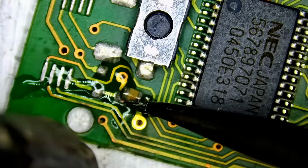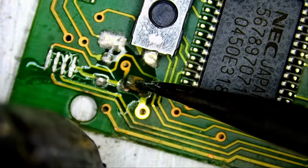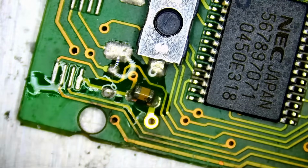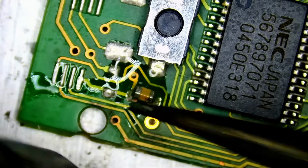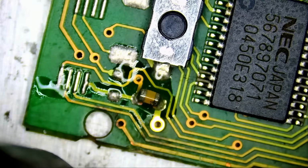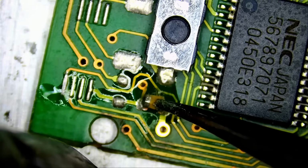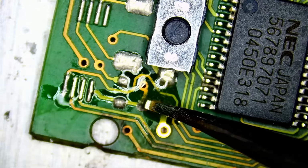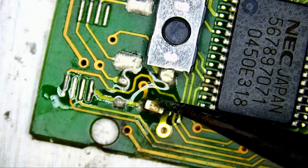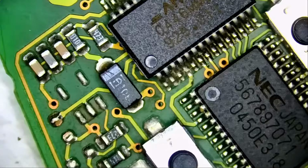We have more fobs that we need to fix, but I'm not gonna include them in this video. We have a BMW fob, we have a Range Rover, we have an Audi, and we have ton loads of Benz key fobs that we need to go over. Some of those key fobs have a triangular panic button, and I spoke a lot about those. Almost always we need to fix broken pads under a BGA chip, on the chip and on the board, both. And I have a video, maybe I'll link down in the description, where we fixed a BGA chip, broken pads under the chip, and broken pads on the board. Tiny microscopic pads.